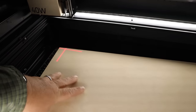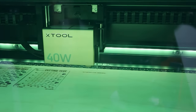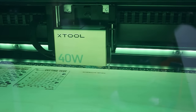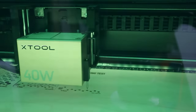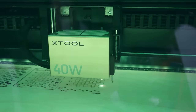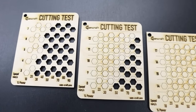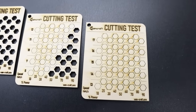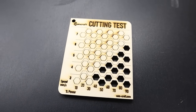When it came to cutting Baltic birch plywood, I do two thicknesses: three millimeter (eighth inch) and six millimeter (quarter inch) true Baltic birch plywood — not birch veneer, but true Baltic birch, really strong stuff and notoriously difficult to cut through. However, with this 40-watt diode, I was able to cut three millimeter Baltic birch wonderfully at nine millimeters per second at 80% power, and slice through the six millimeter at four millimeters per second at 80% power. Both of these were single-pass cuts.